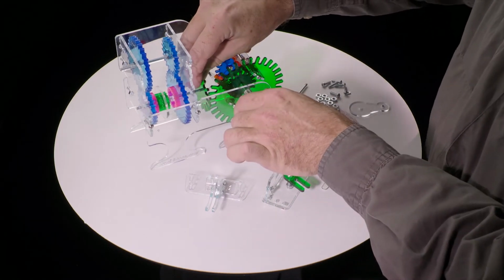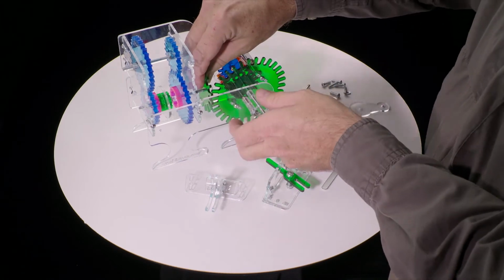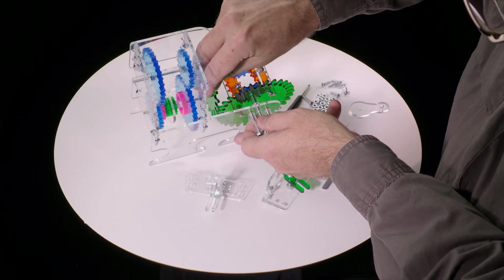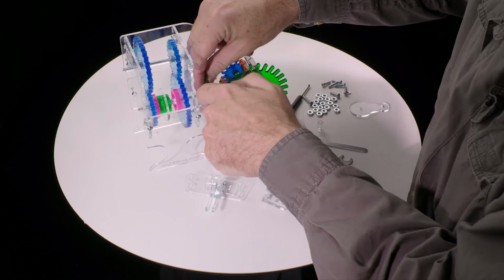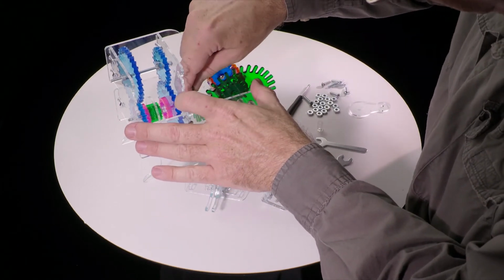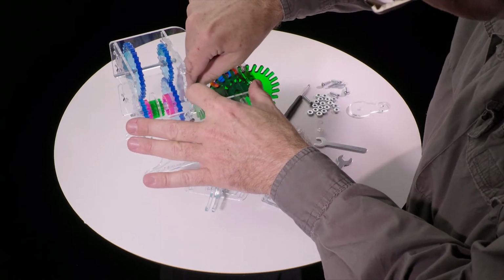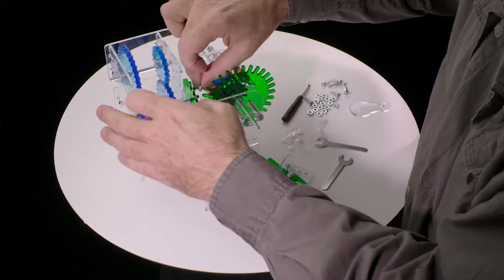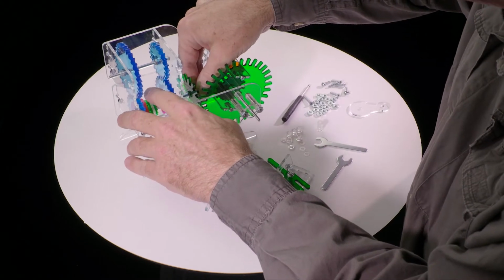Now, the correct position for this gear is just right at the very end of the large gear. So, not back here. It will not turn smoothly. You want to back it up so that just the tips of the teeth are engaging each other. So spin this nut until the point where it seems like it's just those tips are engaging, and then put another nut on. Really very awkward sometimes in here.